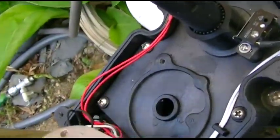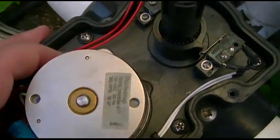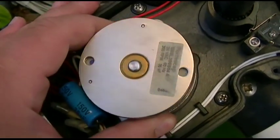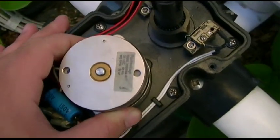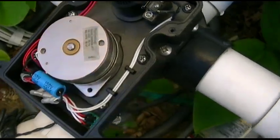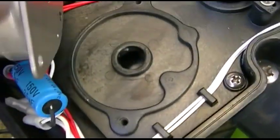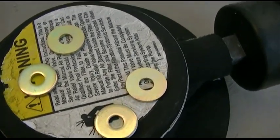Something dawned on me - when this is installed, I took the screws out and you can see how it has a little bit of play. So what I did is I just moved it slightly over like that and held it in place while I actuated the electronics and it seemed to ride a lot more smoothly. So basically what I want to do is get that end part of the gear, which looks to be in good shape, to mesh with that. How do we do that? We raise the motor up, and to do that we're just going to use some washers.